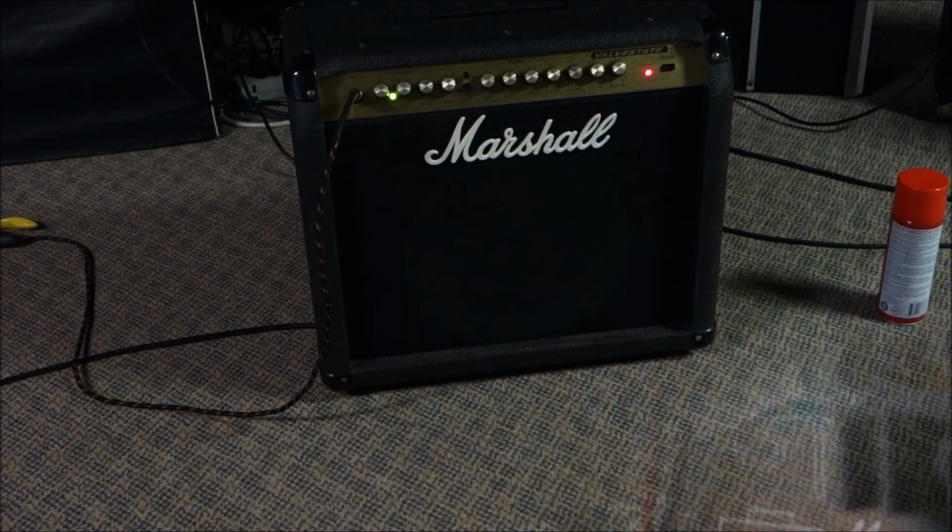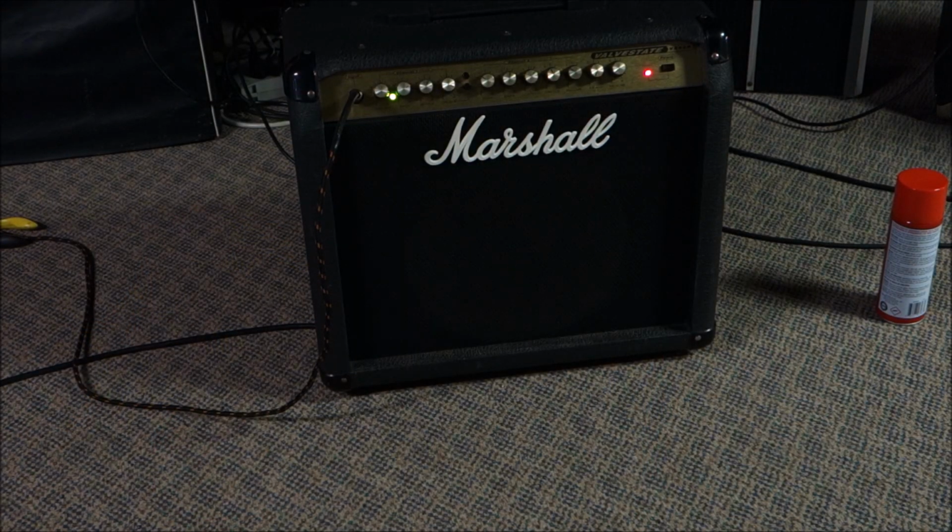Your call. Okay, so the summary is we re-soldered the capacitor that came loose and then put the broken plastic foot back on after gluing it up and repairing it well and washing everything thoroughly. And now we have an amplifier. So clean channel, I don't have it very loud just because reasons.